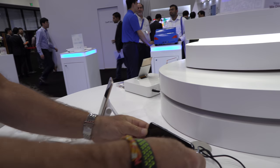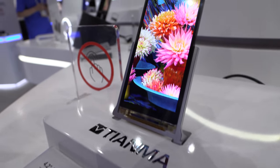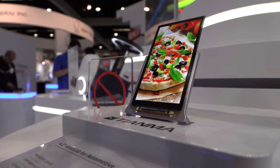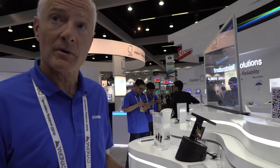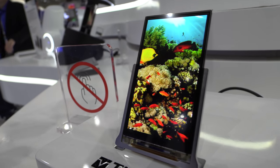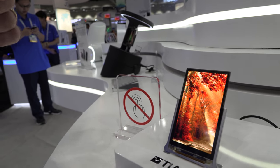This display is quite interesting — it addresses OLED's temperature sensitivity. This 4.2 inch AMOLED came out of the Japanese prototype line and is an attempt to integrate into the automotive area, which requires much higher temperature. This is a reformulation of OLED to withstand 85°C. This display is capable of operating up to 1,000 hours at 85°C and 10,000 hours at room temperature.